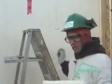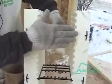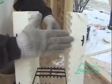As you can see, our boys are cutting the top row of blocks, so we had to hit a specific height. They've cut through the block — you can see the ties in the top. This will be our finish when the concrete's poured. This will be our top of the wall, and the girder truss will sit on top of this.